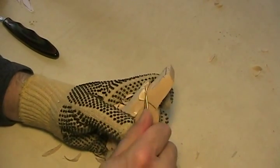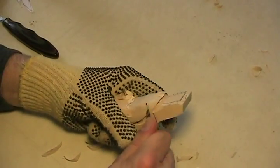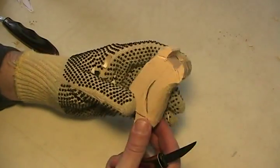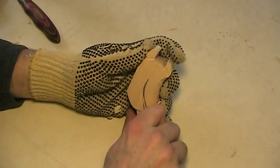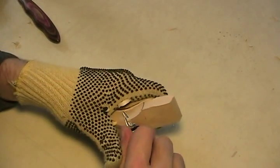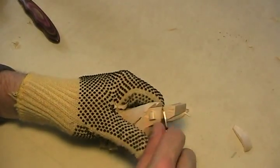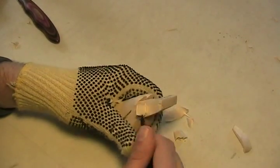And then this goes in. Take the saw marks off. Now I want to do the other side, which is going to be kind of the funny thing — not only are we going to round, but we're going to start taking some of that tail off. And of course, you know the rules: be careful, don't take too much wood off right away. You can always take it off later. I'm sure you've all heard that a million times.